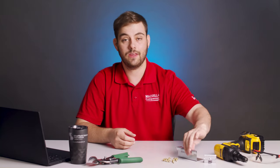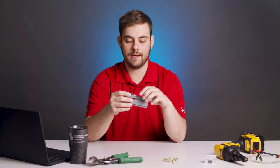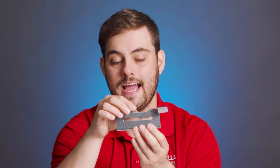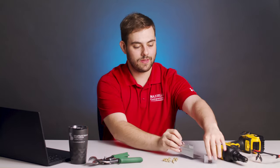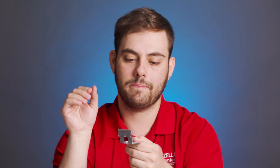When it comes to standing seam roofing that uses a clip like this one here, a mechanical seam panel that uses an expansion clip allows the metal to slide back and forth without the clip base moving itself — allowing those screws to remain planted within the deck and not back their way out. Similarly, with a snap lock panel that uses a fixed clip, the snap lock panel itself moves back and forth over top of the clip and the clip doesn't move at all. We also recommend not pinning a steel roof with panels longer than 25 feet, and an aluminum roof with panels longer than 15 feet.